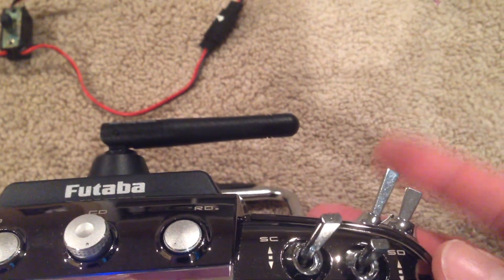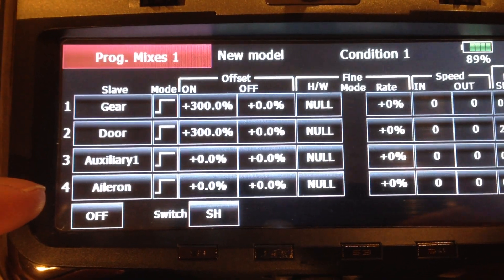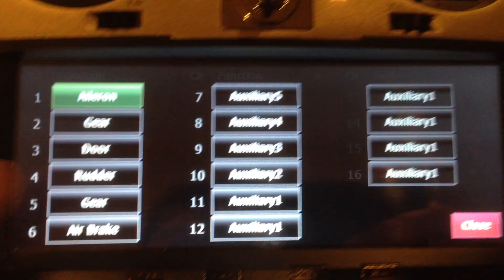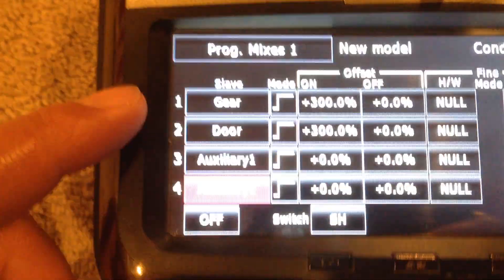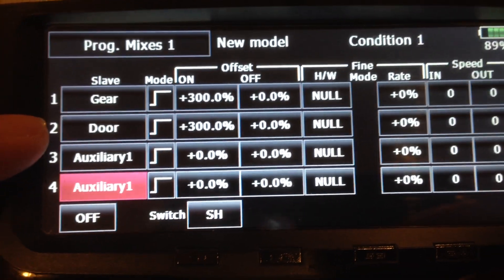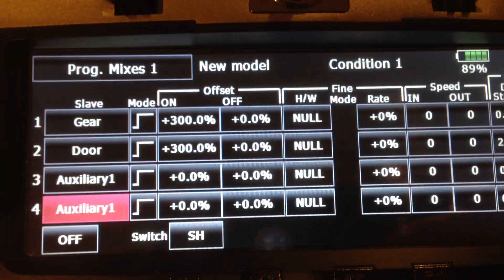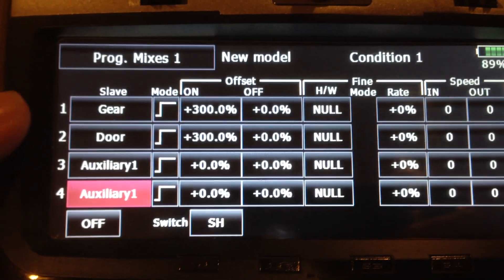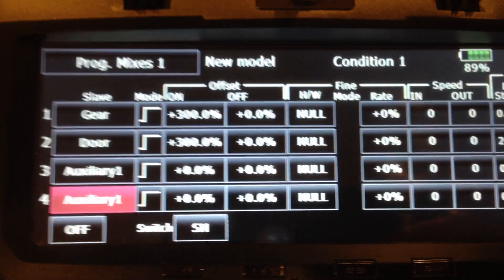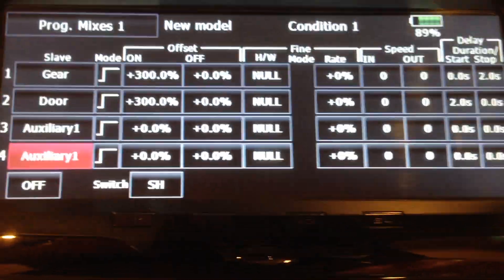You can set which position — whether it be up or down or whatever you want. Now, technically when this switch is triggered, all of these sequences can take place. The first one I set up is gear — that's sequence number one. Sequence number two is the door. I set the others to auxiliary because if you're not using them, it's cleaner. So I'd have gear, door, and then auxiliary. Set your rates — your door may bind at 130, 115, or 112, so you may want to set your door at a certain offset. You can fine-tune different parameters and you can see in the manual what you want to do.